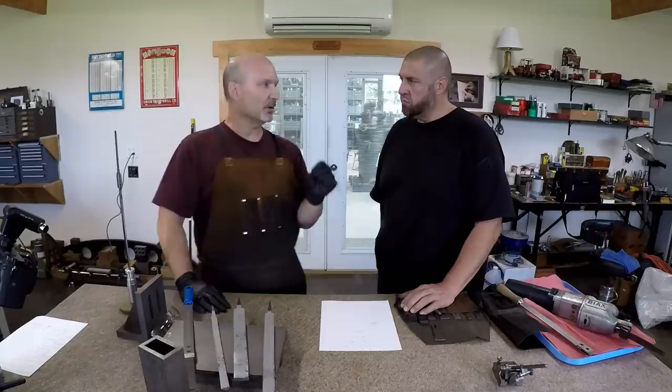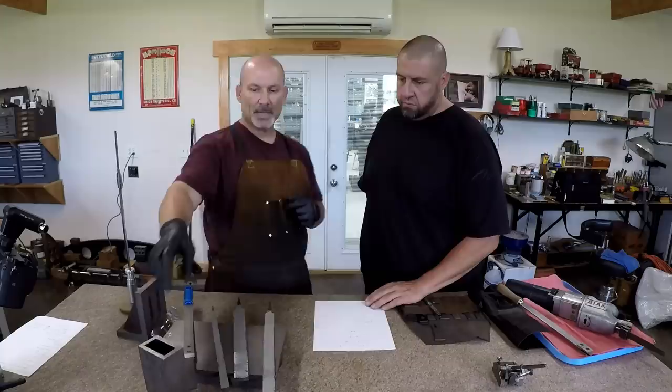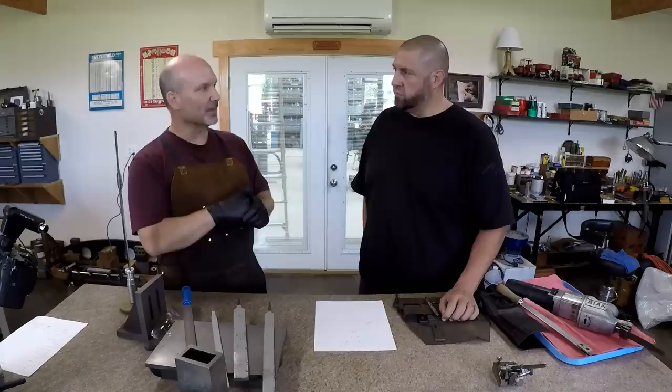You still need a certain percentage, 40 to 50% probably contact, overall contact. But that machine will last a lot longer. Yeah. So Moore talks a little bit about contact and points per inch. And they actually, in the beginning of their book, Moore's book, he describes this, like for the surface plate I did for you.